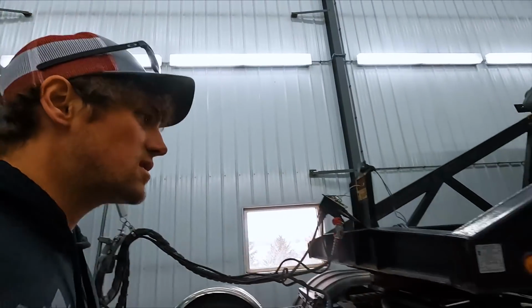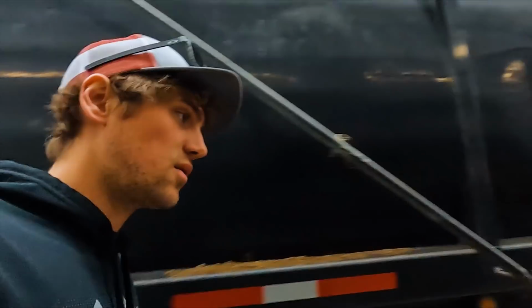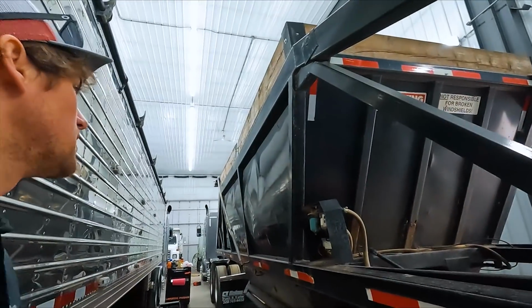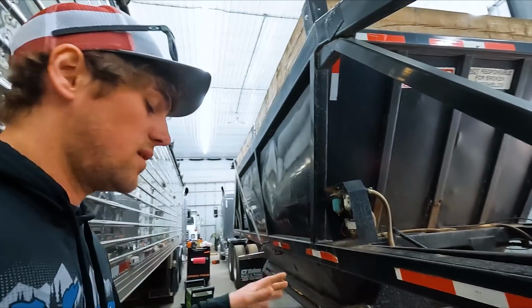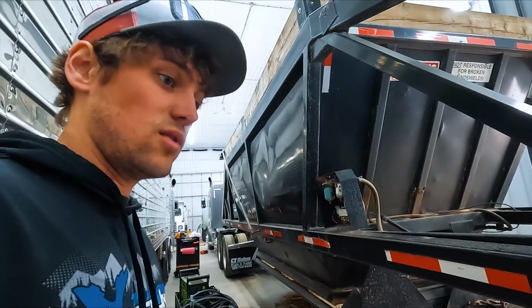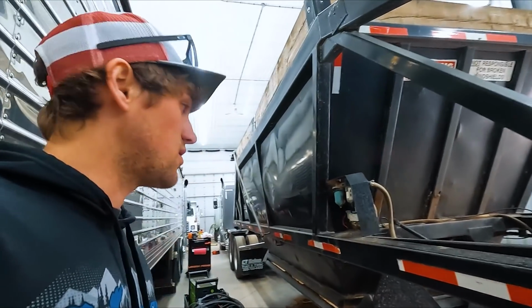All right, so this thing just needs a couple tires pumped. Should be ready to go. I believe it was parked away greased, and everything seems to check out. I checked the wheel seals again, hub oil, that's good. That was why it got brought in here mainly, was that valve too. It was severely junk, the delay. Sometimes it'd open right away, the next time it would take 200 feet. Well, you want to dump it in the spot though, not wait 200 feet for it to open.